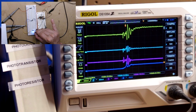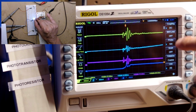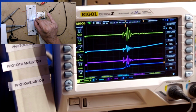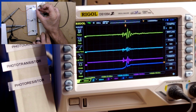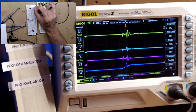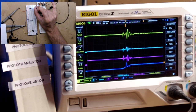You can clearly see here that the rise time on the photo diode comes in pretty quickly. We're at 200 nanoseconds per division, so we're definitely in the under-one-microsecond range. The photo transistor starts to peak up just off the side of the screen, so it takes a little more time to react. For the photo resistor, the fall time is so slow that it doesn't even fall in time to catch the next rise, which is why the whole waveform is raising up.